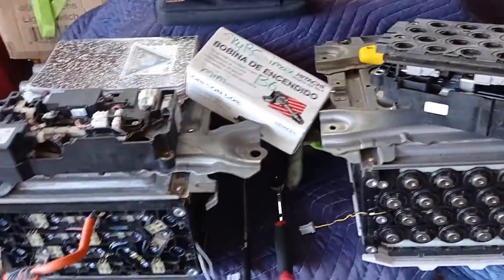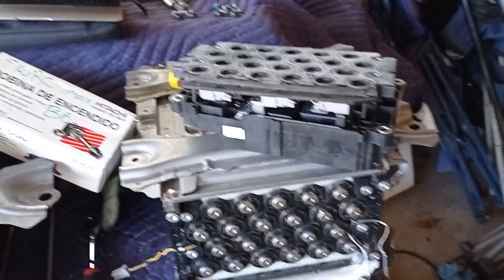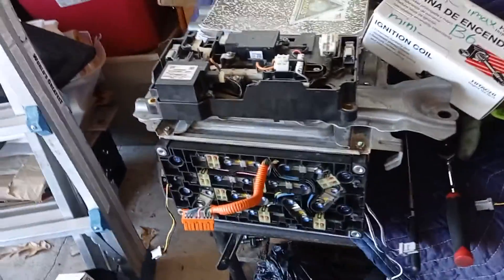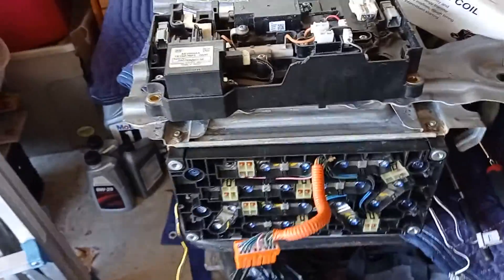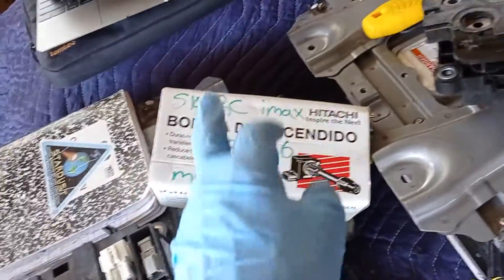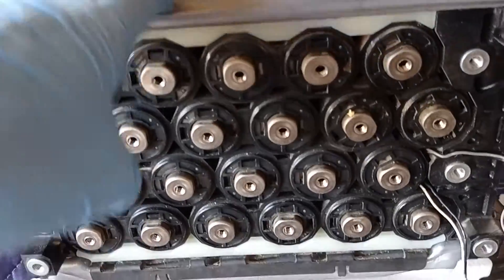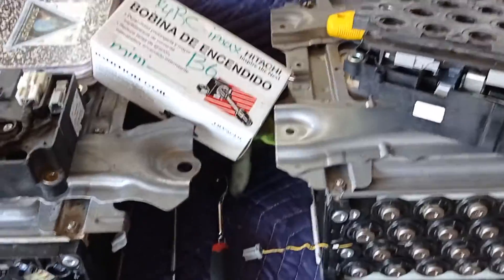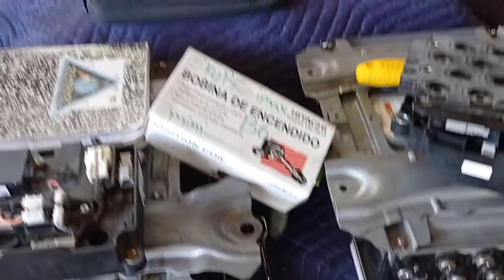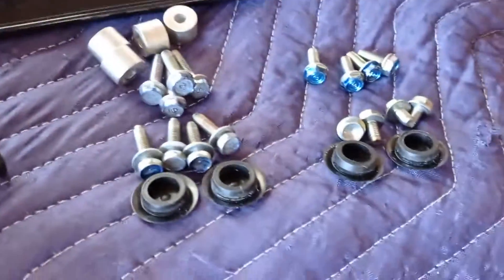Last time I discharged and charged all of these sticks with the iMax B6 Mini. After that I found out this junction board didn't work — it was my first time testing. The other one got results, it was a balanced pack, but it didn't run very well. I didn't grid charge it yet — that's my next step. I'm going to check for the best cells and then charge with the standard Max Volts grid charger that most people use for long-term use. Check out the next video — we're going to look at internal resistance.